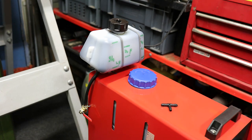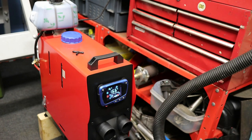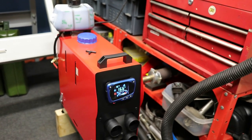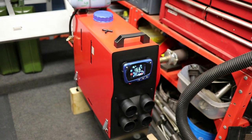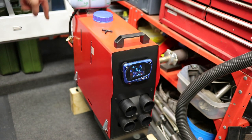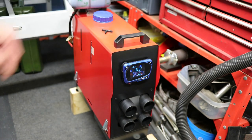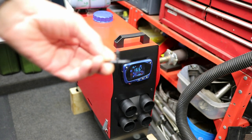It's been on this tank for about 30 minutes. Normally I run it for about an hour or two to get really hot. I'm going to turn it up to maximum so it gets to about 200 degrees centigrade — that cleans everything out really hot. I'm on alpine mode which gives about 198 to 200 degrees centigrade. Once I get to temperature, I'm going to switch tanks. There's a valve for this tank and another one down there for the other tank.